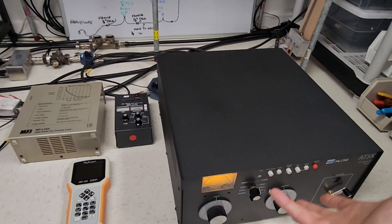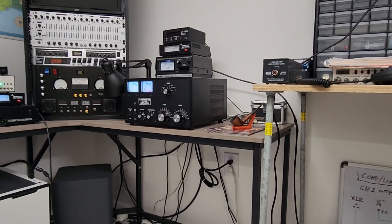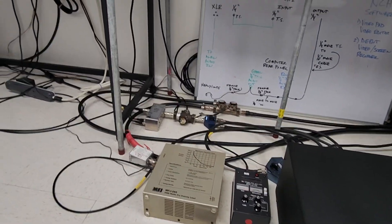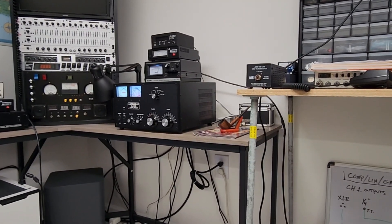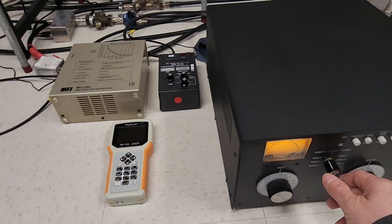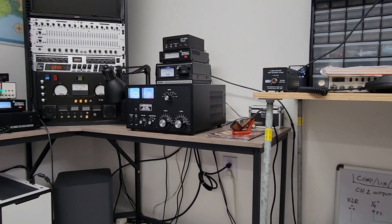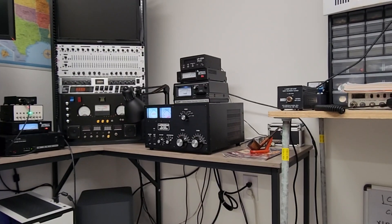Once tuned on the analyzer, I kick the switch back to the ANAN. Now the radio goes through the antenna tuner — all tuned up. Then I check the Ameritron by kicking over to the dummy load, so the signal goes into the dummy load right there. I can do my Pure Signal tune-up or general amp tuning off the air. It works every single time — as soon as you key up, Pure Signal is right where it should be, everything tuned dead on, never had to transmit over the air.